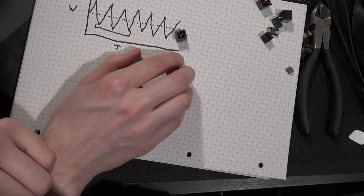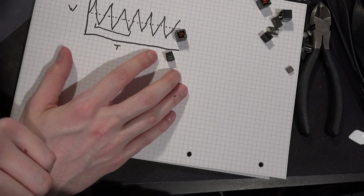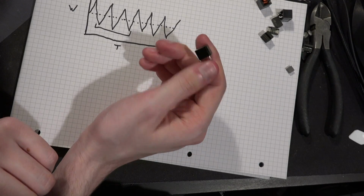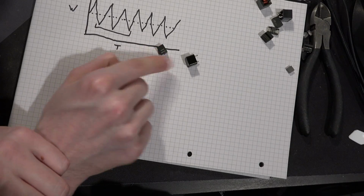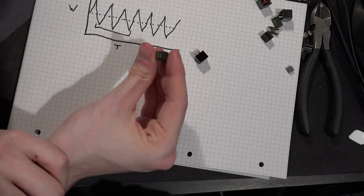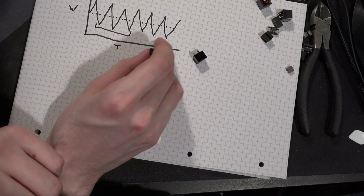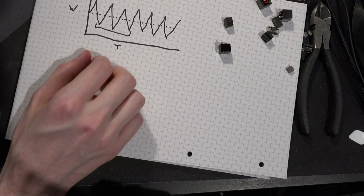For GPU applications, they're perfect because you want a relatively low inductance and you want a very high current handling capability. This thing right here can handle probably 70 amps. This inductor right here, more like 40, right? And so if you're doing a VRM for a GPU, you're going to go with this, not that. Similarly, if you're doing a high-end motherboard, sometimes you'll see something similar to this style as well. And yeah, these tend to whine. That's just unfortunate that their construction is so liable to doing that.